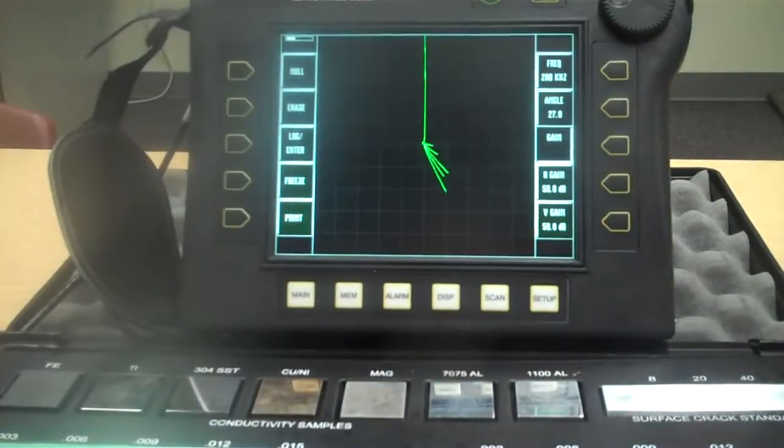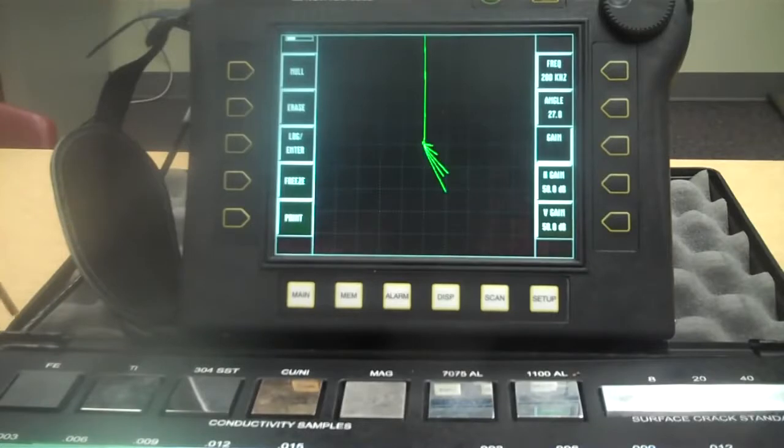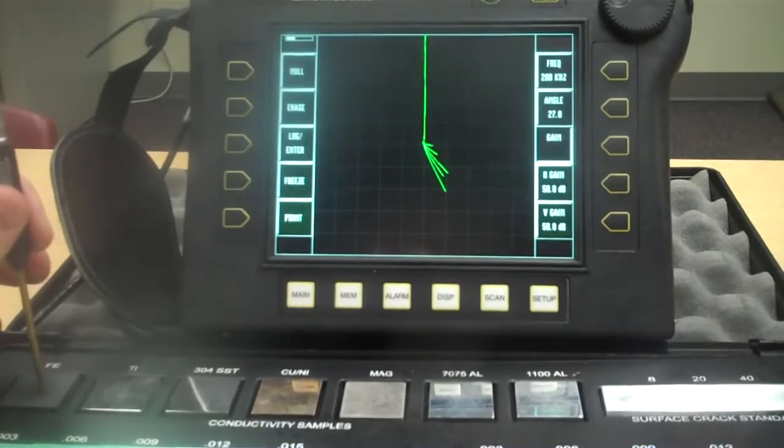And you can see how instantaneous that is. Very, very instantaneous. So for all intents and purposes, we talk about all the inductive reactance stuff. You read about it, it says there's a lag and there's time involved, but all that stuff is in microseconds, nanoseconds. So when we touch our probe to the part here, it's pretty much an instantaneous change. Okay? And that all comes from the impedance of the coil. We're just picking up the differences in the impedance of that coil and where it came from.